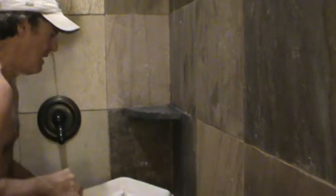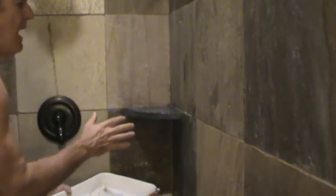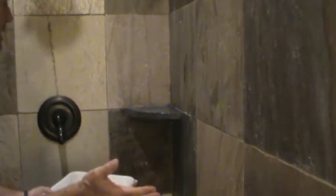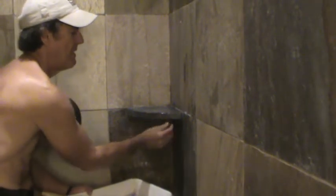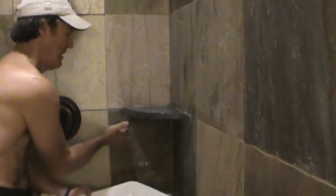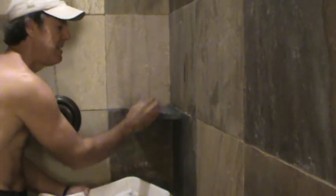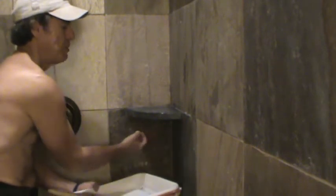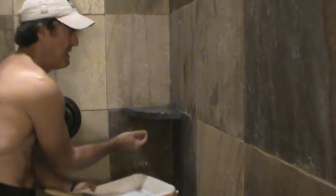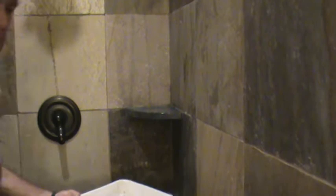If you forget about it, and if you get a drip there and it dries before your second coat, oh yes, if we do a second coat, I put 2 coats in the showers. Every time I do tile in showers or regular kitchen floors, bathroom floors, I put 2 coats. Before your second coat, if you feel anything, you can scrape it off with your fingernail or a putty knife or something like that. That's my pet peeve around these soap dishes and stuff. And incidentally, when I clean this, I still feel around there, and if that's rough, or it feels like a buildup of shampoo, soap, or even sealer from the last person, I take a putty knife and scrape that off underneath here so it's smooth. Okay? Do a good job.